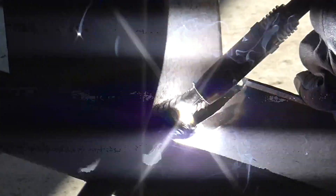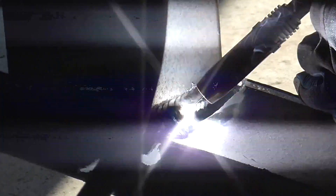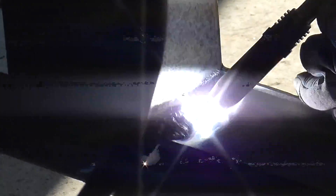After Jeremy welded the front and the back — which was a pretty tight fit — on the top where it was bent so much, there's a gap about a half inch wide on material that's barely eighth inch thick. As you can see, he can fill this in one shot without ever breaking the arc, just lowering the parameters and filling it in. Once it's all filled, he can dial it up, run a really nice hot cover pass over it, and it's turning out mint.